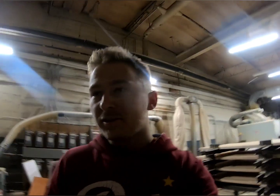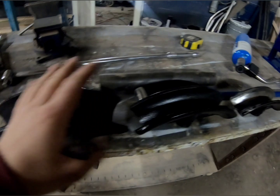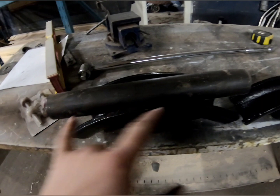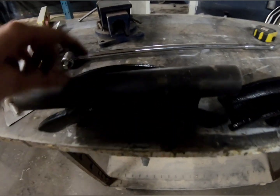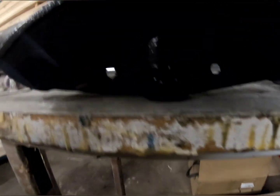This took me days to figure out. I bought this unit and assumed it was just going to bend my tube no problem — ran into this problem right away, pretty much started kinking the pipe. So if you just start using this machine it'll just kink it right away. Long story short: it comes with multiple dies, so as your piston comes up it will bend the tube. As you can see, this die is large — this is a 50.